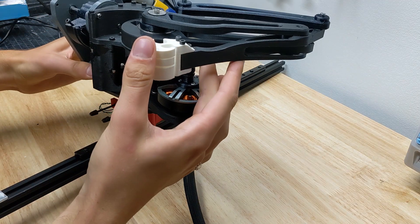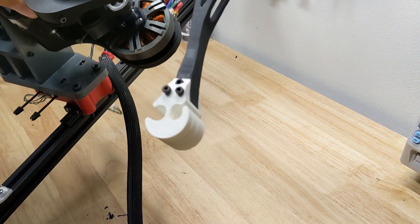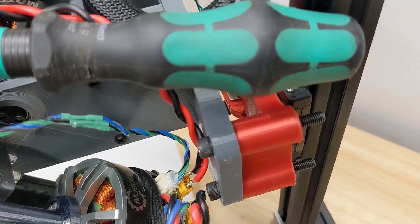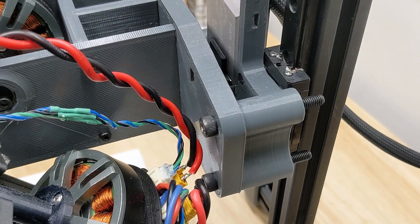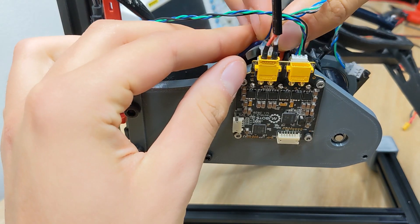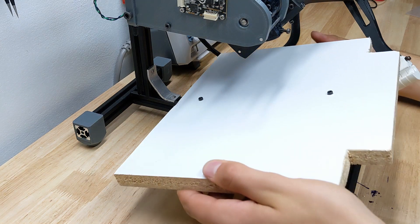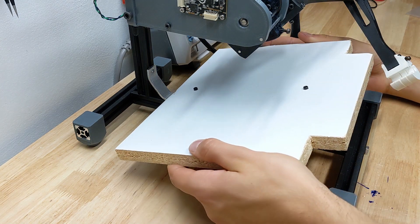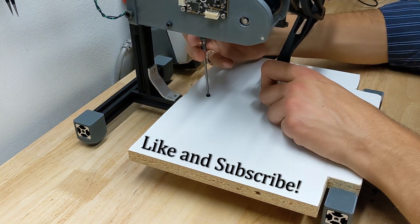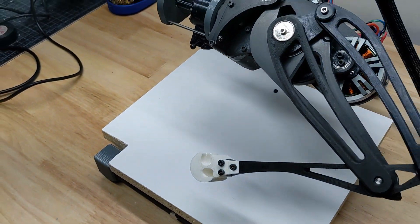This red mounting component that I installed between the leg and the rail introduced a bit too much wobble for my taste, so I redesigned it for increased skookum factor and printed it out of a more rigid material. It's still a point of contention for me, but should serve its purpose for now. Power distribution and CAN bus communications to the leg are accomplished with a daisy chain link of XT-30 plugs and 3-pin JST crimp connectors. The base of this platform consists of an old piece of pressed wood IKEA shelf cut to size, and it should be just heavy enough to counteract the spastic velocity changes of the leg while it's under testing.